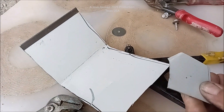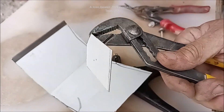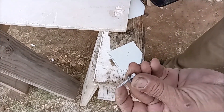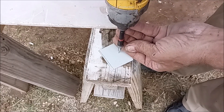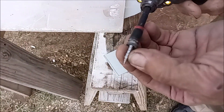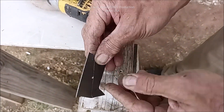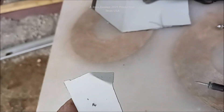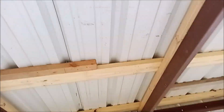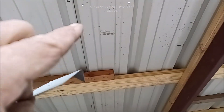Take a piece of scrap metal — this is some 26 gauge — cut you a piece, bend a corner, and then hold that metal like this. I've made a little mark on it, and I'm going to take a very cheap roofing screw and make a hole — but I'm not going to make a hole all the way through. See where I stopped at about one-third of the way down into the width. Now my helper can literally see when he lines this hole up with the hole that's on the roof. There's his hole, so he can hold it with pump pliers or lineman's pliers, and then go up to where the hole is and hold this against it. Then I can get on top and just shoot the screw straight to it.